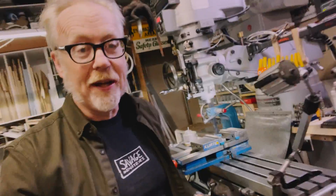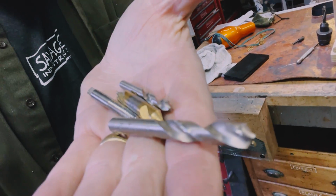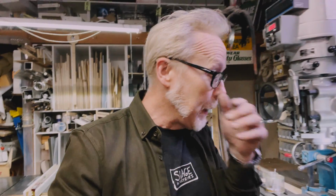Okay, so why is 112 operations such a pain in the butt? Well, partly it's because all of these bits in my hand have different diameters, which means every single one needs a different collet to fit into the spindle of my mill. So that means that for each hole, I am sometimes changing out 5 different collets, or I'm doing 7 passes of all 8 holes while changing out a collet in between, which is more efficient, but there's an even more efficient way.